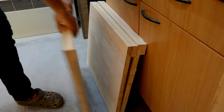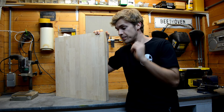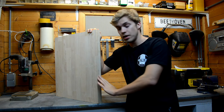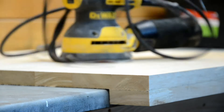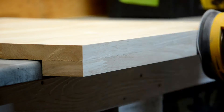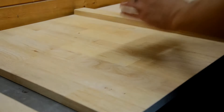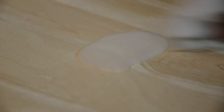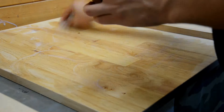So I now have these three shelves. The next thing I need to do is sand everything down, especially all the visible surfaces like the front edge right here, where I glued two pieces together. I'm using a water-based clear furniture finish on the shelves, since they will only be used for towels and whatnot. I applied it in two coats, top and bottom.